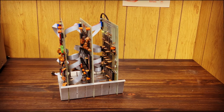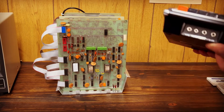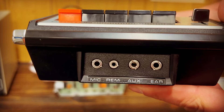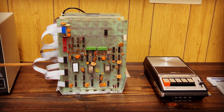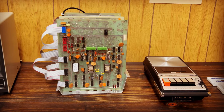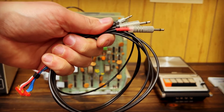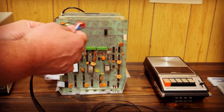So now our computer should be able to read and write from cassettes, and here's a fine-looking portable cassette recorder. It has microphone and earphone jacks like any good tape deck, and we can use those for directly connecting input and output audio. These two sockets provide all the many input and output signals for all the different serial interfaces, including the cassette audio in and out that we care about. But there's no standardized adapter for this, and Sphere didn't provide one — you were expected to figure out how to make those connections yourself. Here's the wiring harness that I made. It connects the input and output of the tape recorder into the correct pins on the board socket.